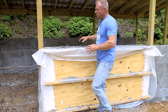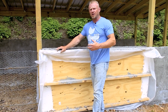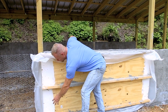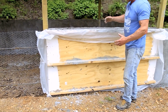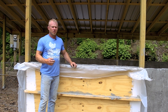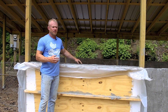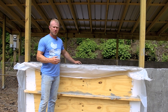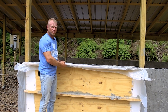Once we put these forms up, we are caulking them with silicone caulk because the mix is a little runny — aircrete is a little thin and it'll run out on you. We found that caulking at the corners, with a few screws between the two by fours and gravel or dirt piled up against the bottom, keeps it from running out. With any concrete form, you need a good releasing agent if you're going to reuse the form. We initially started by painting our plywood on the inside with a sealer, but aircrete sticks a little more than traditional concrete. So we went to just wrapping the form in plastic on the inside, because it releases much easier.